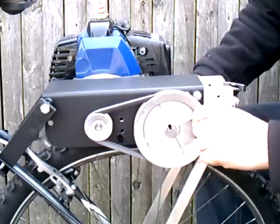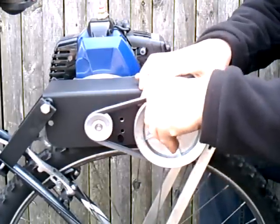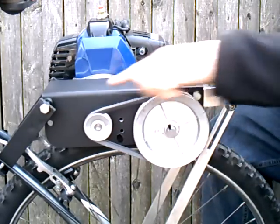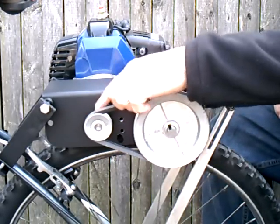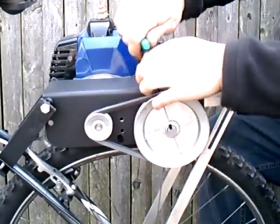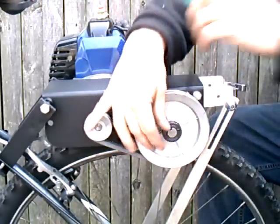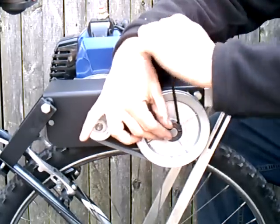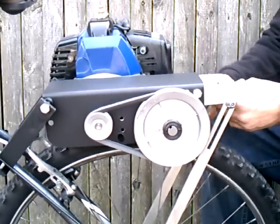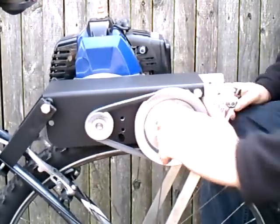After that, you're going to have to line up your keyway and install your three-sixteenths key — you might have to push that in there with something. Once you do that, these two pulleys are in alignment. There was one shim on this side and two on this side because this was a little narrower. You can then tighten down your set screw on the rear pulley and simply put your shaft collar on. Give it a little rotation — it rotates nice.